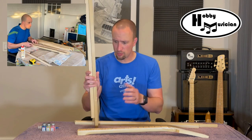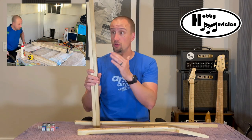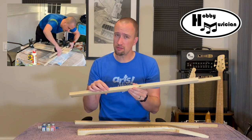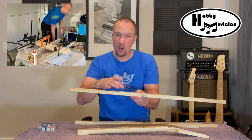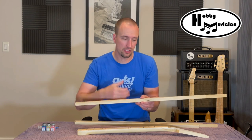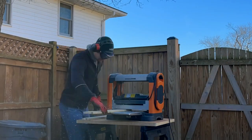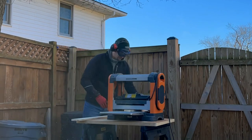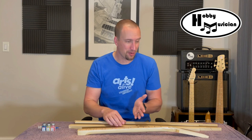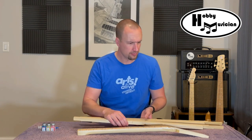The guys doing that project said, 'This is all junk — take whatever you want, we're gonna throw it away.' So I laminated these together — laminating is just a fancy word for gluing small pieces to make a bigger piece. I pulled out pieces that were long enough and glued them together to make planks. The height wasn't tall enough, so I made two identical boards, ran them through the thickness planer to get perfectly flat faces, then glued one board onto the other to get a blank thick enough for the rest of the process.